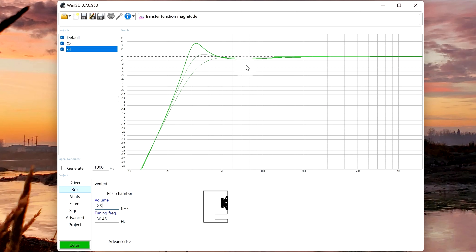So you want to do the trade-off, and for me that trade-off is about two times — maybe just a little bit under two times — where I feel I still have great sound quality, get a little bit of a bump, some free bass essentially. Now that we have those three parameters, next we want to look at cone excursion.